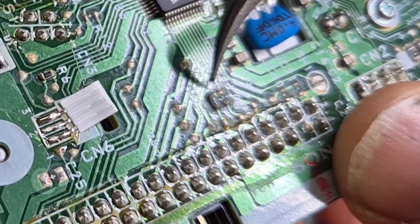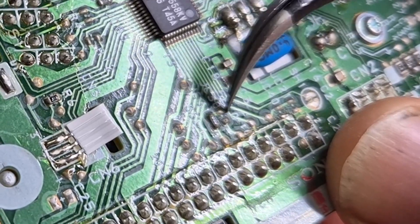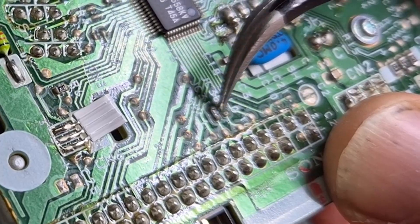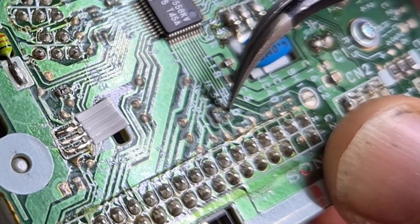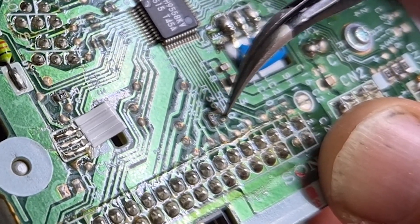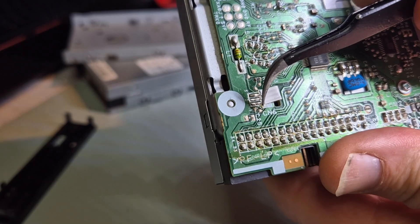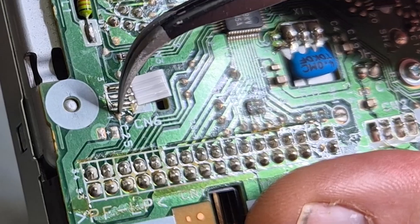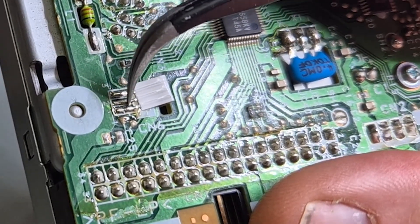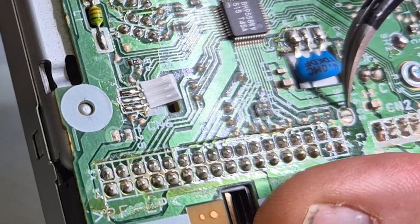Just a jumper. We need a JC-31. We need to disconnect that and put a JC-30. Or if we lose it in the process — it's quite small, which can happen — if you don't have a microscope, we're going to use just a little piece of wire. And third, we need to connect a wire from here marked by where number one is. It's number one for this connector, but it is a little pad here. And we're going to connect that to this guy here.